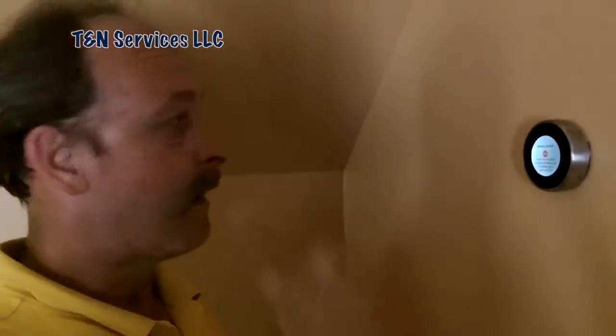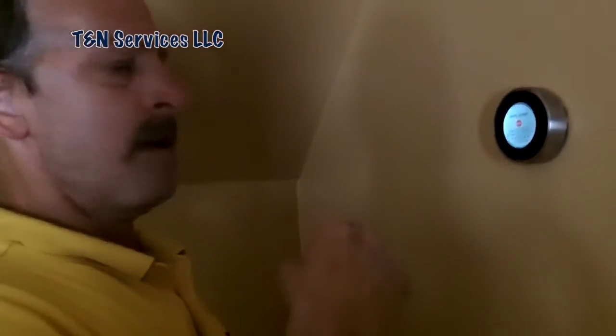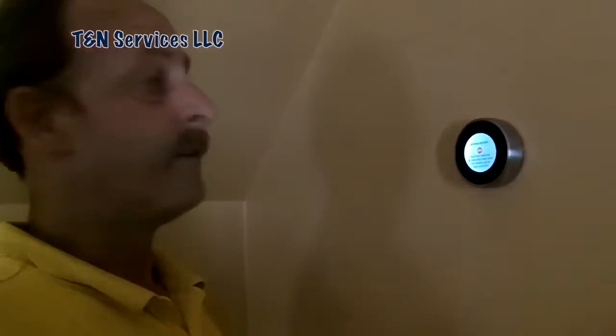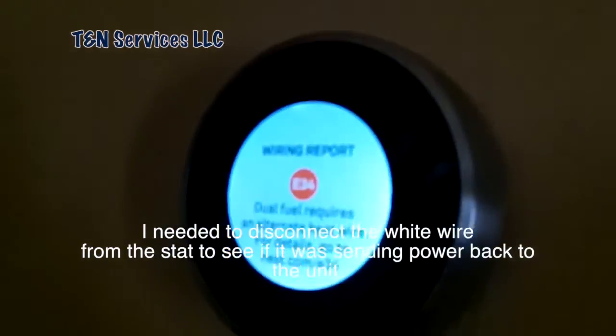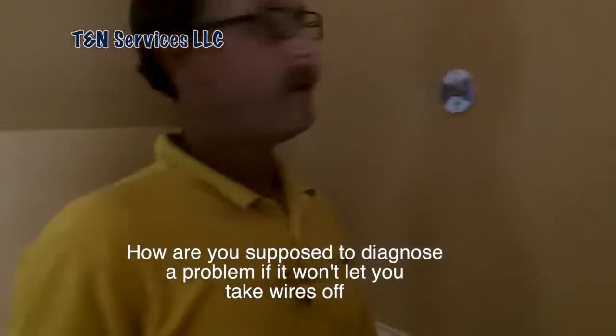Now we've got to give it five minutes to see if it's working. I hate the stupidness. Let me tell you why I hate the Nest. Because I disconnected the W1, put it on W2, and went through the setup. It comes back on and it's still sending power to the damn unit. So I said screw it, I'm just going to disconnect W1 from the thermostat to see if I'm getting the signal back. And the stupidness says: 'We don't detect the wire and dual fuel requires an alternate heat wire.' What the hell do you want me to do, people?